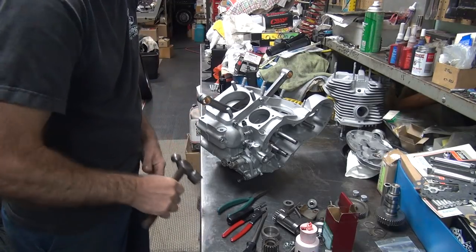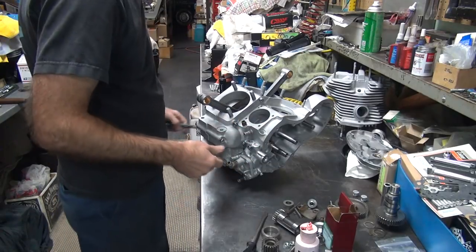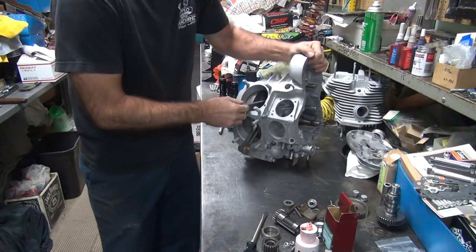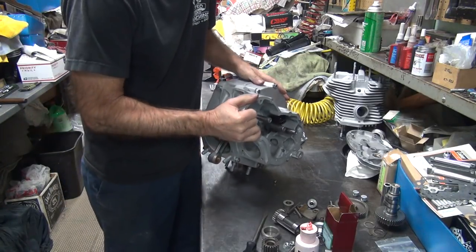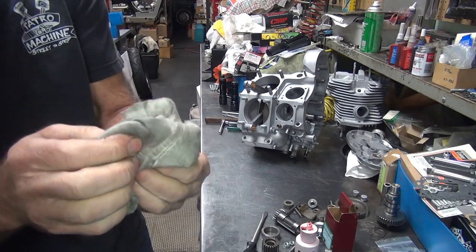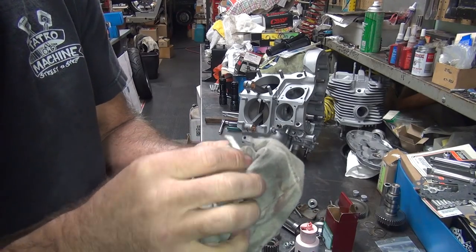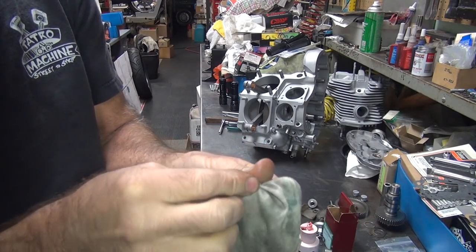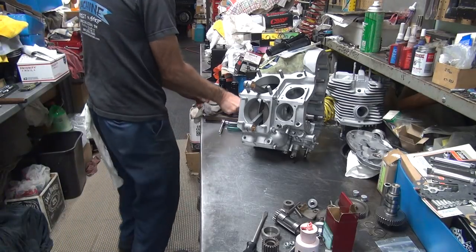I use the old ball instead of a new ball. The new ball's over here. Now I've got to get this old ball out — I already put oil in there, but gravity helps in this situation. Rotate it around and it'll fall out. There's the ball. So I throw these in a drawer and use them for beating on the lower pumps or weld them onto the lapping stick. I don't reuse them after I beat on them — at least not for an oil pump.